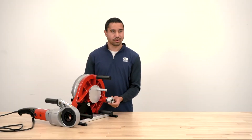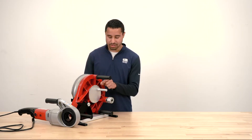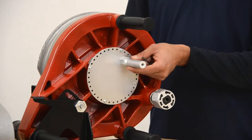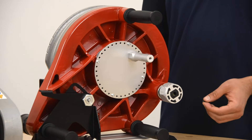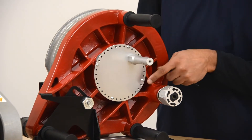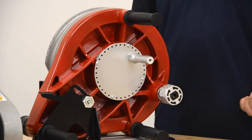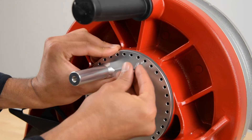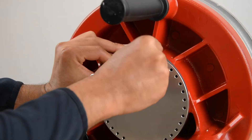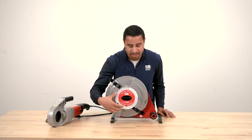Similar to adjusting the 11R die head, depending on the type and size of the threader you're using, you may need to adjust the back plate and post to make sure the post lines up with the hole in the threader so it can be held in place during bends. To do that, there are four screws on the back plate — use a three-millimeter metric Allen wrench to loosen them, then rotate the plate to the correct position and tighten the screws back up. The angle indicator dial on the front of the bender can actually come off so you can store items inside.